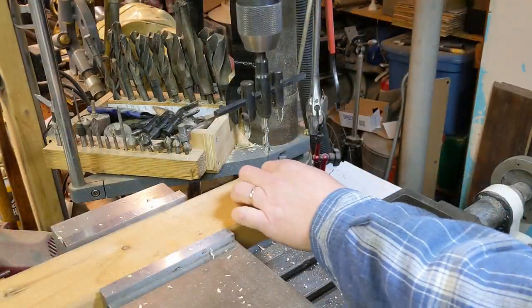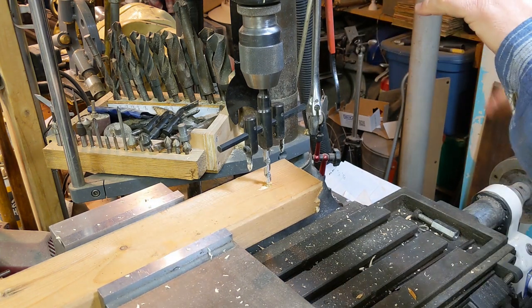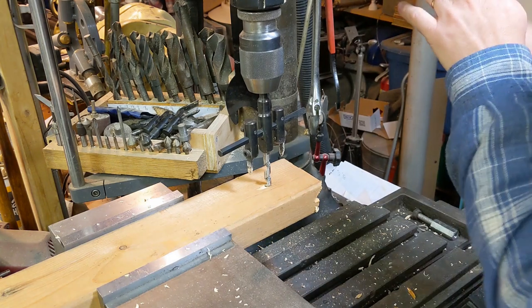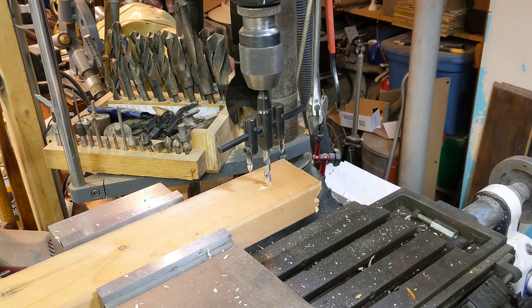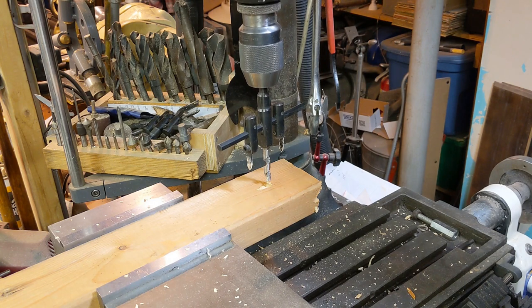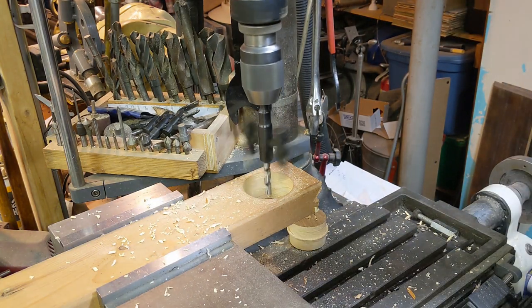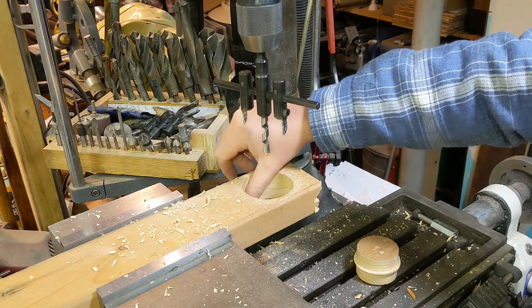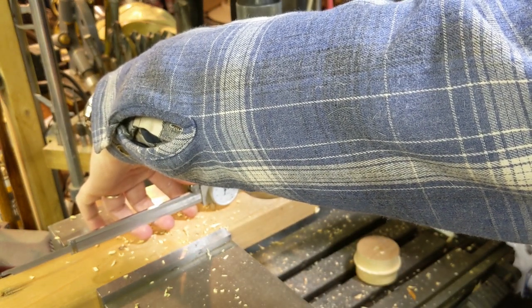I'll flip it over and cut this plug out just for the joy of it — because the pilot hole goes all the way through it's not too hard. By the way, if you're a woodworker, you need a mill drill — a round column mill/drill press — so your drill press can be moved incrementally within thousandths of an inch. I can't imagine doing this woodworking without it. And there you have it: nice clean edges and a nice clean hole. I can barely even feel a rib in there. Let's see how we did for size — 2.550, on the money.